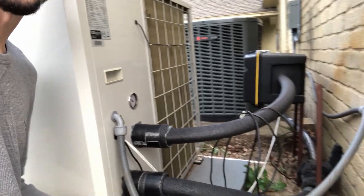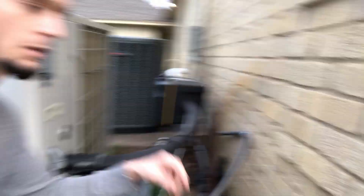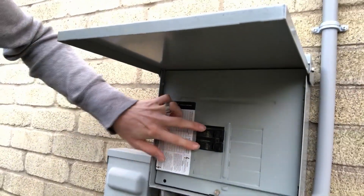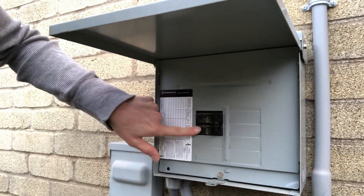You've got a water in and water out, and of course electricity. I went ahead and ran a panel out here — this was where the upstairs outdoor unit was, and I wanted the Chiltrix unit here rather than behind the house. I ran new electrical from the attic down to here, and instead of just a disconnect I installed an actual panel with a 20-amp breaker and 240-volt connection, with enough capacity to run another two Chiltrix units of the same size — so that would be six tons of cooling, which is what this house was originally.